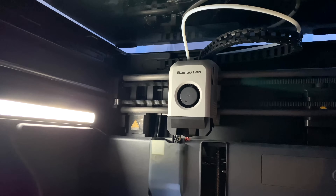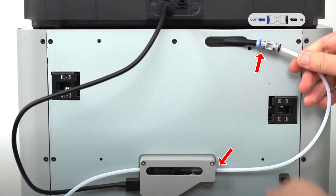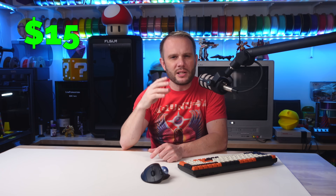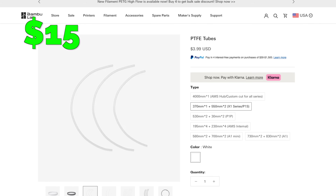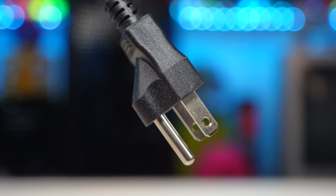Then there's PTFE tubes. A lot of machines today are running complex PTFE systems, and these tubes take a beating over time, especially with aggressive filaments that eat up nozzles. PTFE degrades over time, causing increased friction, inconsistent extrusion, and eventually you'll need to replace it to keep your prints looking nice and sharp. Most printer companies have PTFE kits on their website, ranging from just a few bucks to as much as $20 or more. I'll have links in the description for good quality nozzles and PTFE kits.